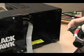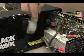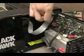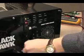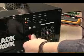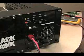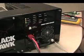To reinstall the module, line up the edge of the module to the track, then align the top edge to the top track. Connect your ribbon cable and make sure it is latched. Hold the ribbon cable up to prevent it from catching on the corner of the heat sink, then simply slide into place. Tighten the three screws. Reattach the battery harness and temp sensor, then turn the battery breaker on.